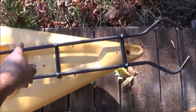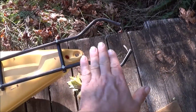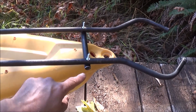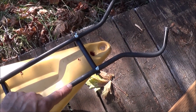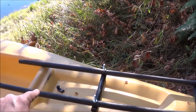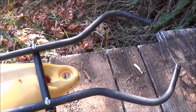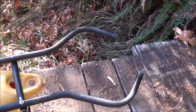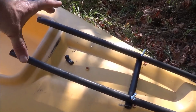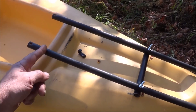So here's the first thing I've done. I took the two outside rods of that fold-up chair — the ones where the armrest went — and I've put those out flat so you can see the arc in them is flat to each other. Then I took just one of the shorter crisscross arm pieces and cut two pieces at six inches wide out of that, drilled some holes through there, and put two nuts and bolts on either one of those. Now I'm setting up the spot against the kayak where I'm going to mount it — right about here looks perfectly level all the way across. That should give a nice distance out from the end to where the electric motor mounts. We're going to deck that area with probably a one-by piece of planking. And back in here I'm going to cut one more six-inch long piece and put that right here against the back edge.